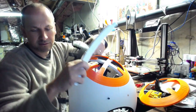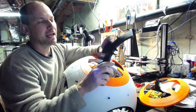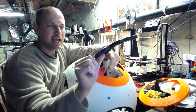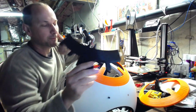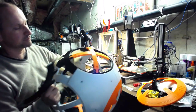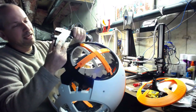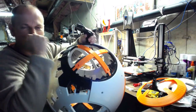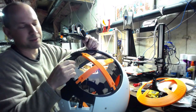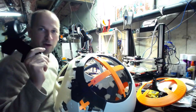This is a design by a fellow by the name of Carrie Christie II. It's a really cool design in that it is one modular piece — one segment — and these segments go together four at a time. You put four of them together, they join together, and you put a little washer in there — an aluminum washer or an American penny — and a little bit of filament in there just to act as a little alignment. You glue those together, they form a ring, and you wind up with six rings, so you have to print this part 24 times.